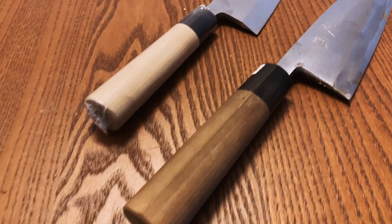There are a couple of things that are really important to keep in mind when you're thinking of a traditional Japanese knife. These knives are generally handmade — there's a blacksmith that's hammering them out and there's no high-tech equipment involved. Generally it's experience. The blacksmith is literally hammering away, getting feedback from the hammer into his arm, looking into the furnace at the color of the flame to determine how hot the metal is getting — is it orange, is it white? He's determining from experience.